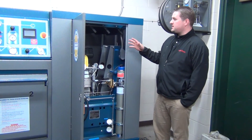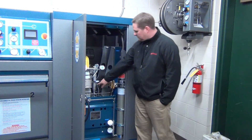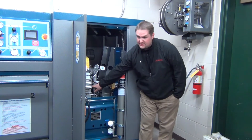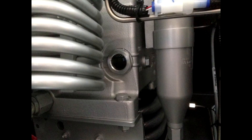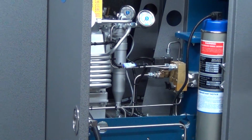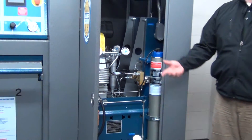When you first start your compressor — before you start your compressor — you want to check your oil level. There's this little sight window everybody should look at. There are two lines, a low and a high, a minimum and a maximum. You want it somewhere in between there. It's a synthetic oil; it's not just any random 10W40 off the shelf.